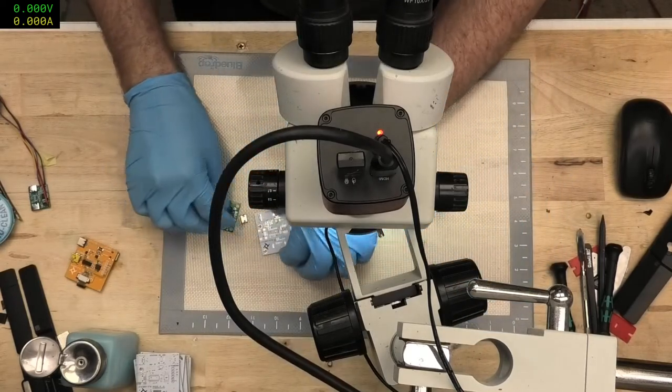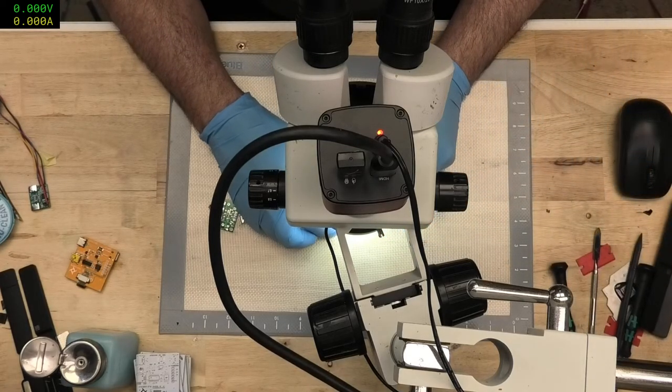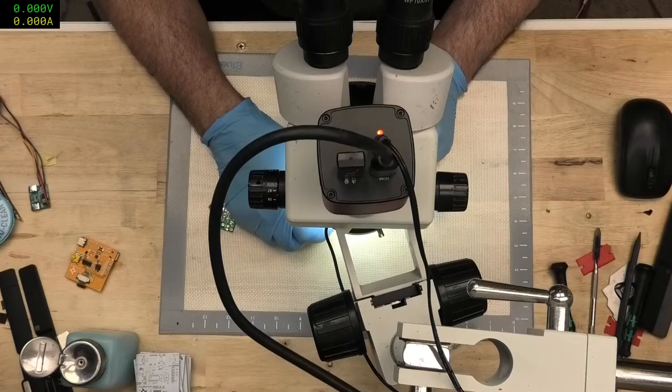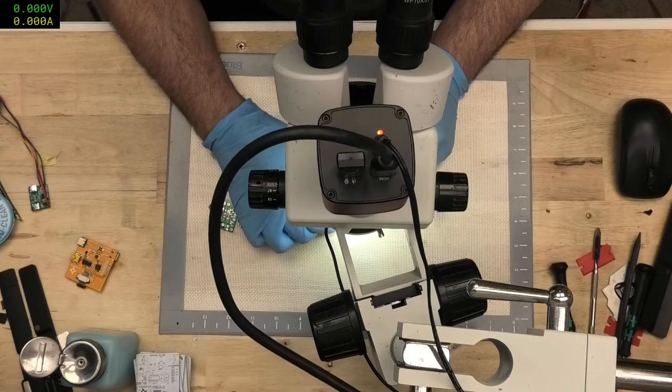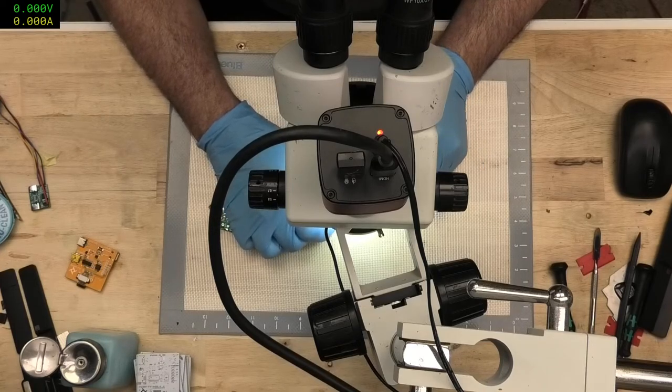Oh, what the hell? I wasn't supposed to pick up that entire thing. But with this chip here, this is supposed to be the INA-238. The sense lines I've got down here are not meant to be there. So that's a big fat screw up. But like I said, you can just ignore that whole section. You've still got I2C, an AVR, a display, and a serial to USB converter. It's still a useful little project board.